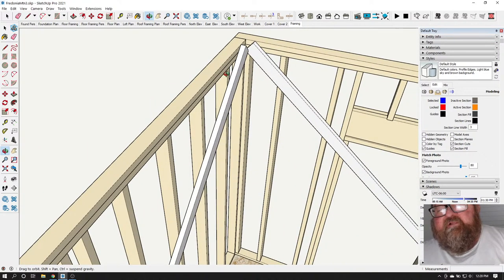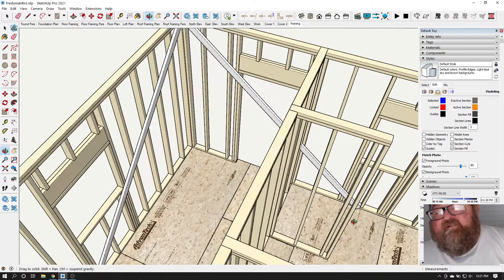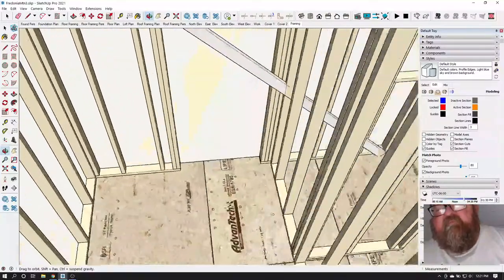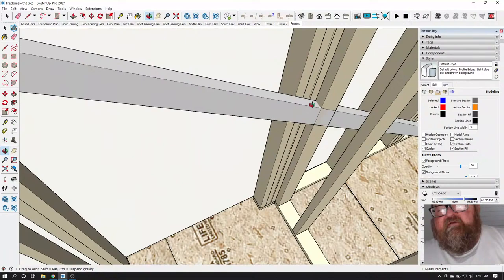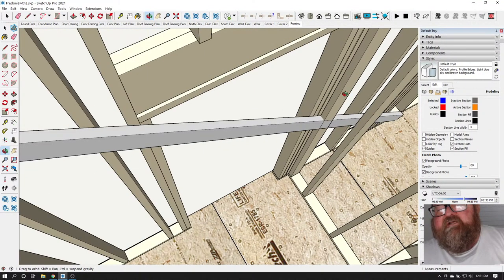Turn your level the other way and plumb the wall back and forth in this direction. When it's right, shoot your nails — you'll probably have a nail gun — bam bam, come up here, bam bam. In real life these 2x4s will bend around the studs because the grain runs in this direction, and they'll just bend around that stud.